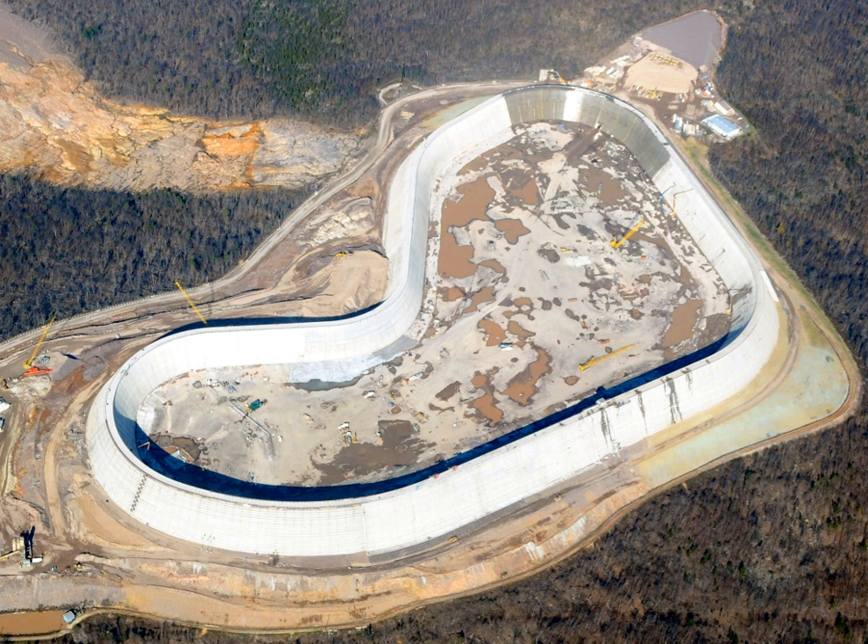Within a few years of construction, problems were noted with stratification of the reservoir water, caused by upstream pollution and anoxic decomposition, which produced hydrogen sulfide gas. Concerns were expressed that this could give rise to sulfuric acid and accelerate damage to the concrete. The controversy continued for some years. In 2004, an aeration plant was installed to address the root cause in the reservoir, as had been suggested 18 years earlier. In the quarter century since Willow Creek, considerable research and experimentation yielded improvements in concrete mix designs, dam designs, and construction methods. By 2008, about 350 RCC dams existed worldwide. Currently the highest dam of this type is the Chinese Longtan Dam at 216 meters, with the Pakistani Diamer-Basha Dam under construction at 272 meters.